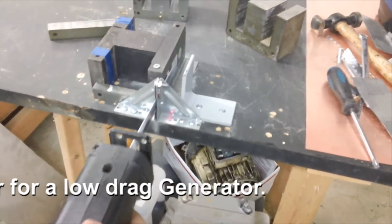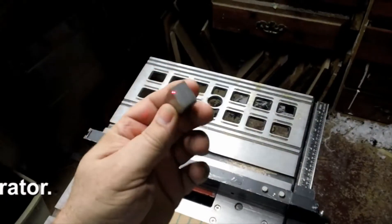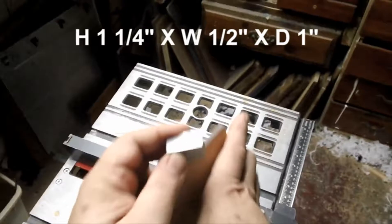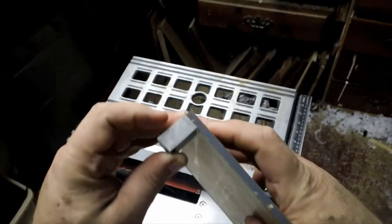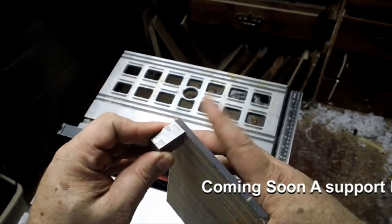What we're going to do here: this is a core for the motor, it's one inch by one and one quarter. What we're going to do is make some end caps for this. So this will be a cut off, and then we'll round that, and that will make the actual end cap that we're going to put the screw in.